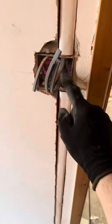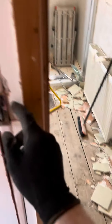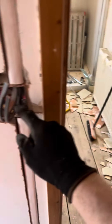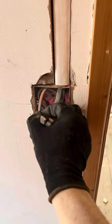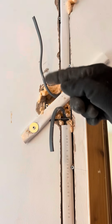I've got a cable for the shaver socket over there, and the feed in here — I've done the shaver socket not as part of the loop because I'd rather be able to disconnect it if she wants; it was a maybe. So I've got a feed in and a feed out which goes up into the loft, and I'm going to terminate into a Wago box. I've got the switch line going straight up behind that box and over, then a three-core which goes into the fan isolator and out.